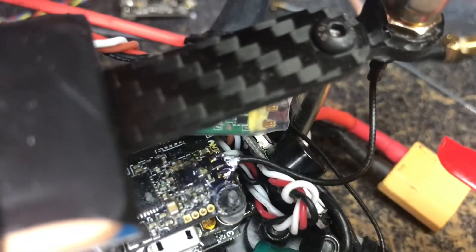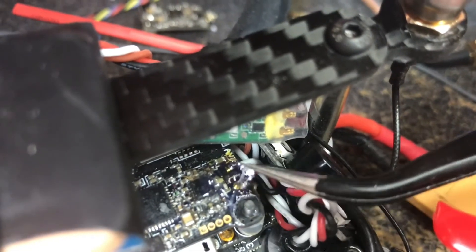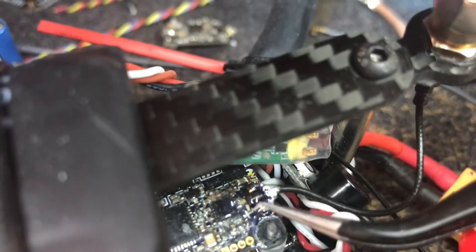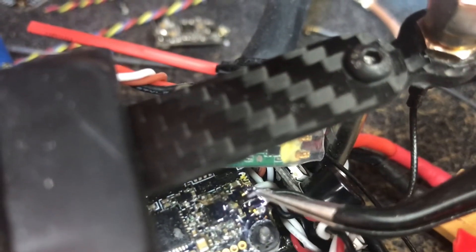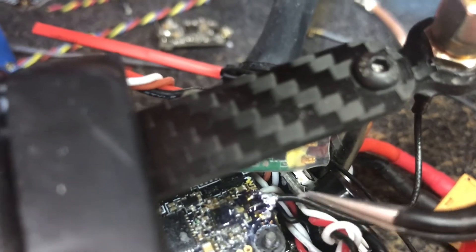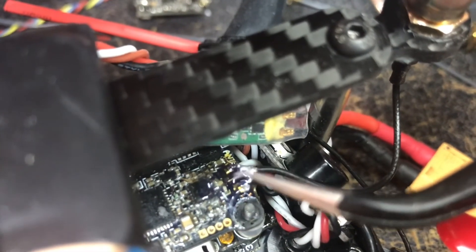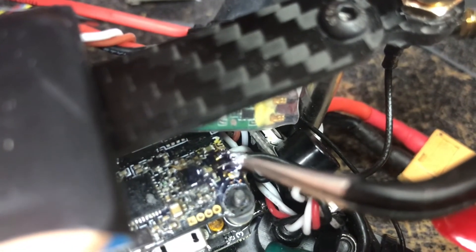Here this is in action. This was the antenna, and I broke one of those little UFL connectors off. Right now this is still drying - that's the conformal coating. There's the center element soldered to the centerpiece, the element. This is the right fork and the left fork. So this is actually still connected, and then it comes up here to this video transmitter. That little mini UFL connector actually came off, and I just soldered it right back up, and she's going to send me video from a long way away.